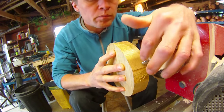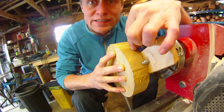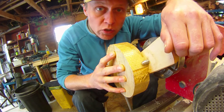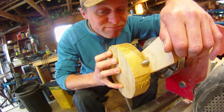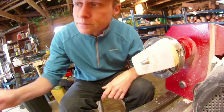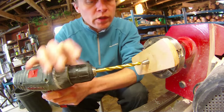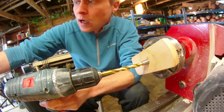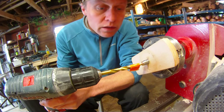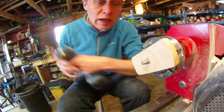So when I put the blank onto the worm screw, I've got much more space here to put a recess. And also, because the piece isn't very big, it doesn't matter that I haven't got the full depth of the worm screw going into the wood to keep it secure — it's fairly small so the risk of it coming off is pretty slim. I've found the centre of the piece, I just need to drill it and get it onto the worm screw. I need to find out how deep to drill the hole in the blank, so I put the drill bit up against the worm screw and just add a little bit of tape onto the drill bit. When I drill the blank, I just go down until the tape touches the wood, and then I know I've got the right depth hole to screw onto the worm screw.